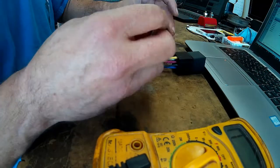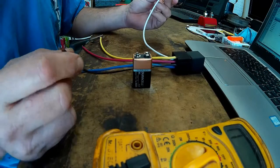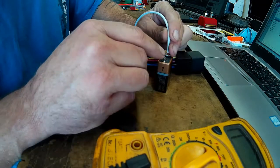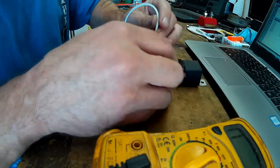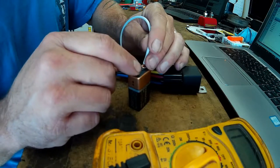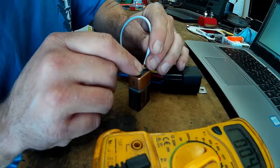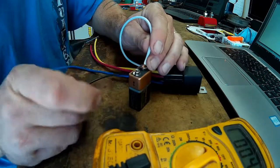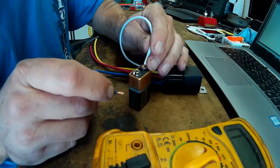So now if I want to fire off the relay, I just have to connect our two trigger wires, our 85 and our 86 wires, to the 9 volt battery. And you can hear the relay. And you can hear that we have a continuous circuit now. So whatever device we have connected on our yellow 87 wire is going to be powered at this point. So if I take away power from the trigger wires, the circuit opens and there's no connection between the two.